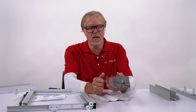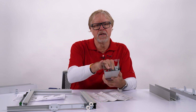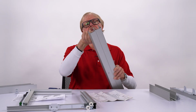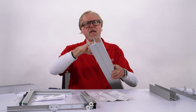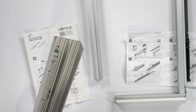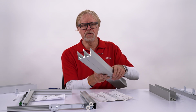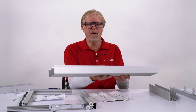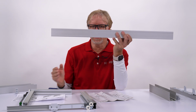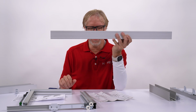As you get ready to hang this in the top of the closet or the application that you have, as I mentioned, you need to slide the soft closer into this pocket with the actuator in this bigger space, like in this case in the center flange. Okay, so you can leave it loose when you first install it, because you're going to mount this up here, and then you're going to be able to adjust it to get that door to close right at the side jamb of your closet or application that you have.